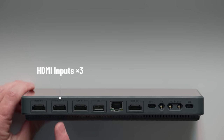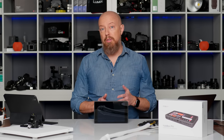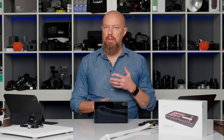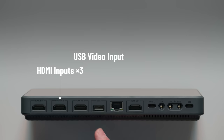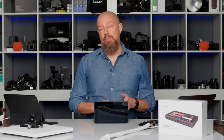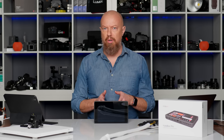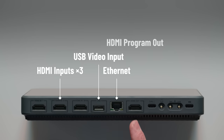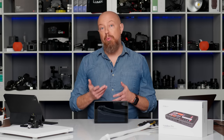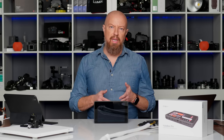You've got HDMI in number one, two, and three — three HDMI inputs, each one with a scaler on it. You can bring in just about any flavor of 720 or 1080 into this and it'll scale to whatever production size you're doing. You have a Type-A USB port which actually supports webcams — a really common request for the ATEMs that's not supported on those devices, but is here. There's an Ethernet port and an HDMI out, which can output your program or can output the same interface that you see here — think of that like a multi-view out.